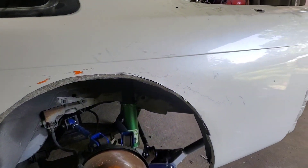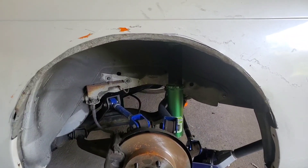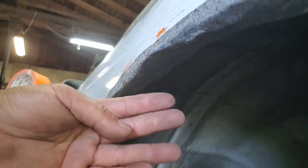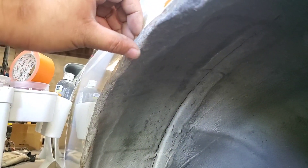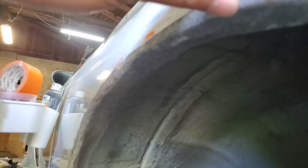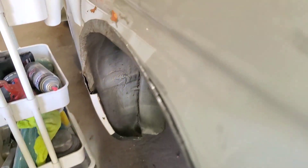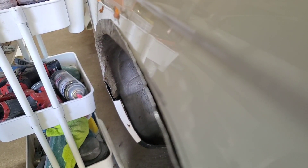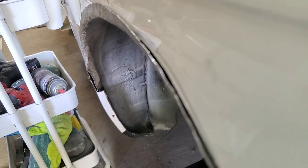The rear of the S14 has been radiused. While being radiused, it's simultaneously capped off with its own wheel well. I hammered this inner wheel well out, constantly hitting it from the underside and the outer lip. With the ball peen it stretches it out, and when it stretches it gives you enough material to work with so that this end can be flipped out — flipped inside out, much like how you can flip your eyelid open, and it holds in place. This is pretty much the exact same thing that we're doing here.